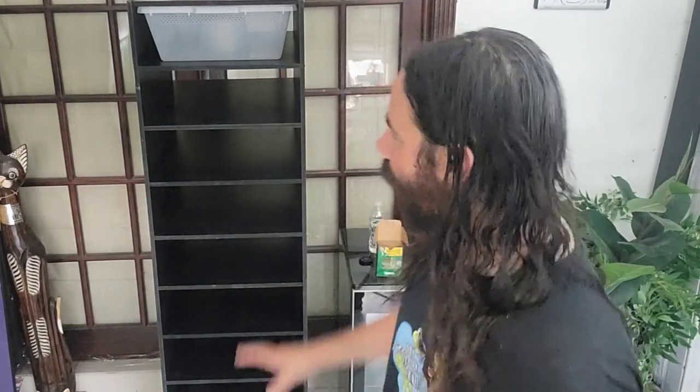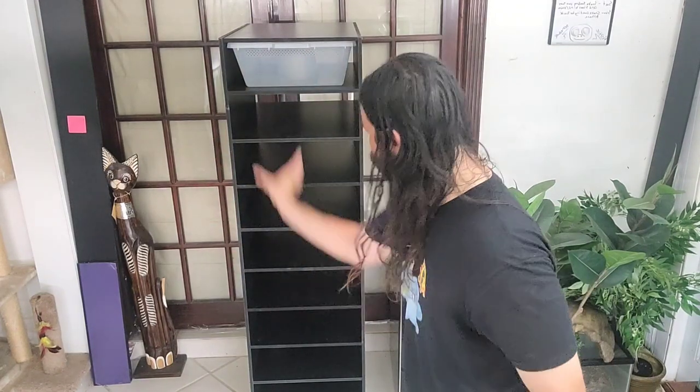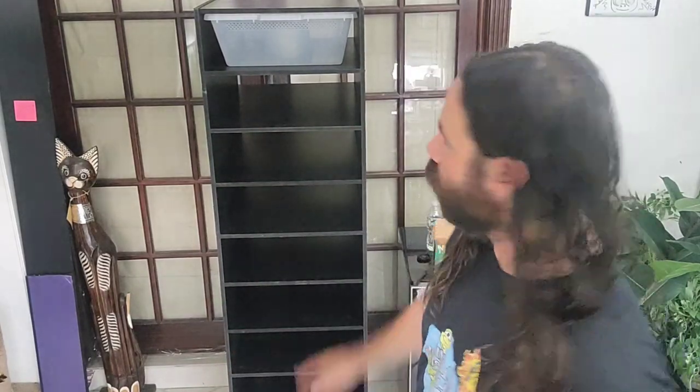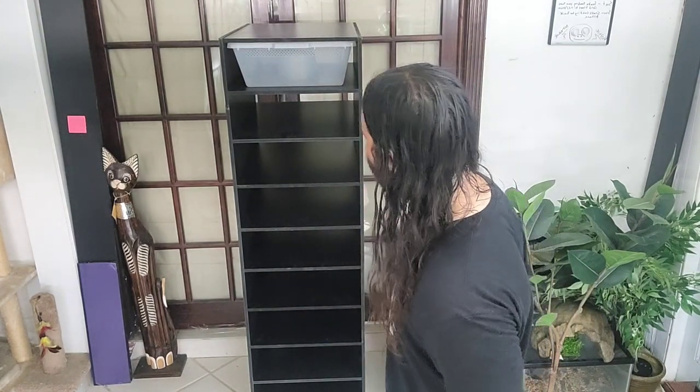I have a lot of excess PVC — when you make your cuts at Piedmont Plastics they always have excess. I have enough to cover the backing. It won't be exact but it'll be in strips. I'm going to put the heat tape on the back. Now if you live up north and you want belly heat, you'll need to put belly heat since it's colder, and you'll want to totally close this off. To conceal the heat, you would need another panel seventy and a quarter inches tall by twenty-four and a half inches long, and it'll be flawless.